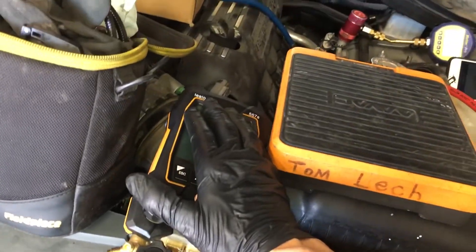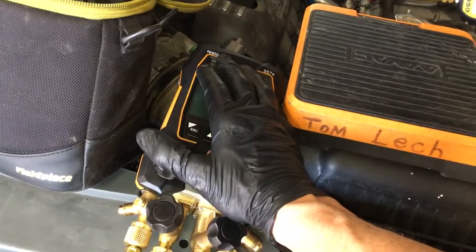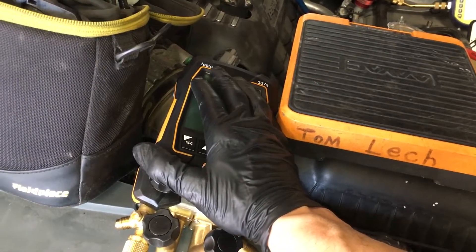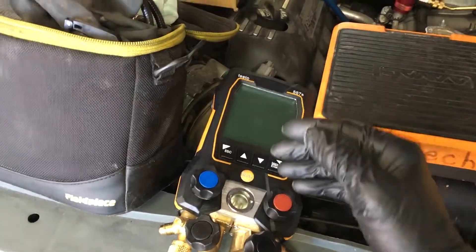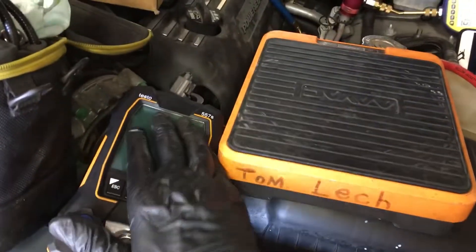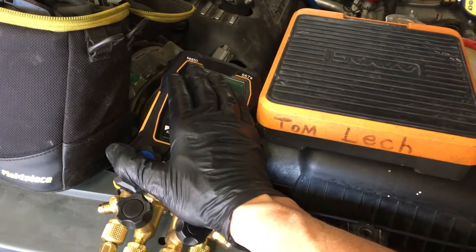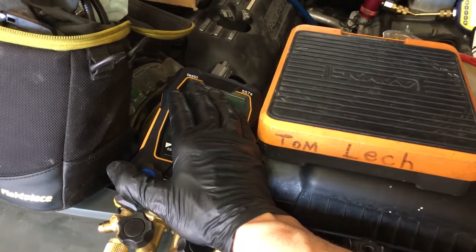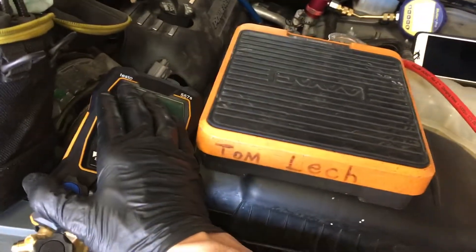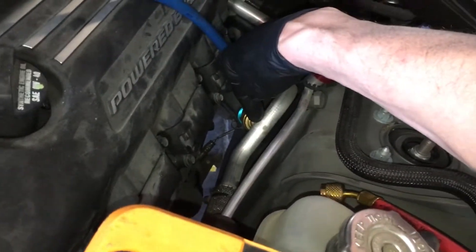We're drawing a vacuum through a refrigerant manifold, which if you want to test and draw a deep vacuum, that is not the way to do it. But everybody wants fast, cheap, easy — so what do you think is going to happen? I'm in a live shop with a compressor that was just going. The manifold is not the way to draw a vacuum if you want true, deep readings. I'm taking a reading off the high side and drawing vacuum on the low side — so it's at the complete opposite ends of the system.